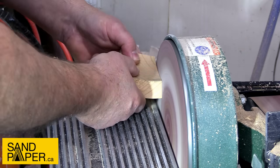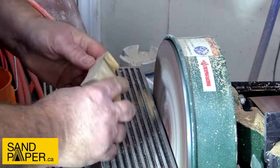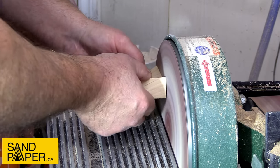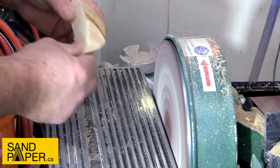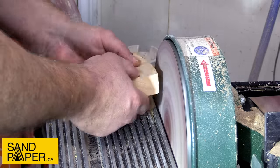That bandsaw blade that I'm using has 3 teeth per inch, and it's actually a woodturner's bandsaw blade. I get it from Rd bandsaw blades here in Ontario. There is a link in the description if you want to get blades like that. But it's their woodturner woodworker blade, and it's got a wide kerf on it.